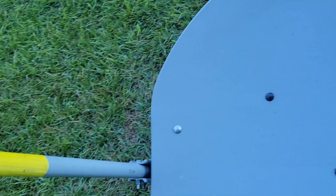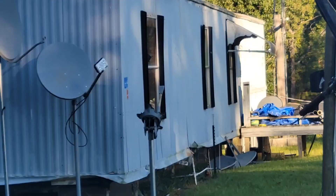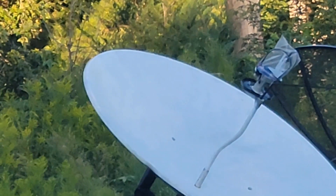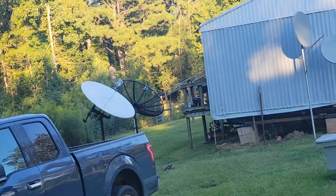I'm going to do the same thing with this other dish - I got my holes, all I do is put my holes in here off this one. I'll pull this LNB off this huge net dish I got here, same thing - drill my holes, put my bolts through there, and put my LNB right along here, aim it that way back down, set her on the pole and find a satellite. I got several of these huge net dishes - I'm going to put one on that way over there. I'll also see if I can spur a couple of Ku LNBs off this solid one here using that scalar ring - put a clamp on there and run a couple LNBs off that as well.